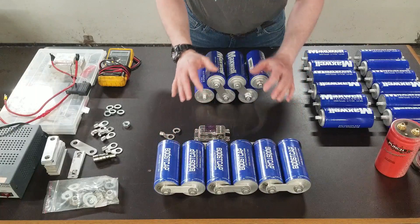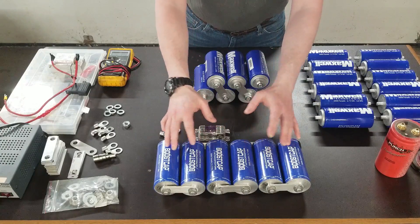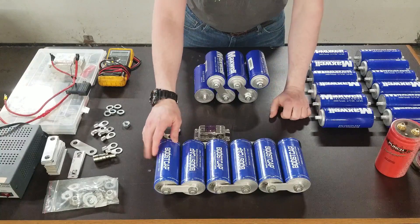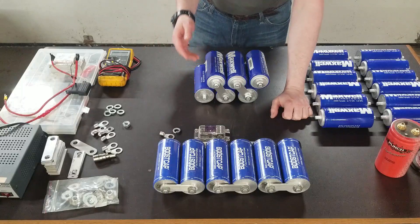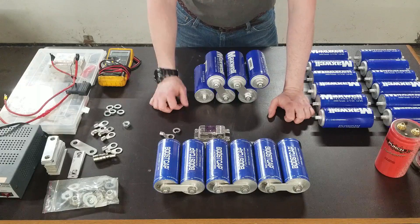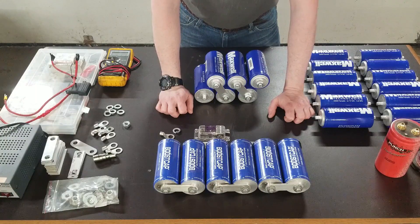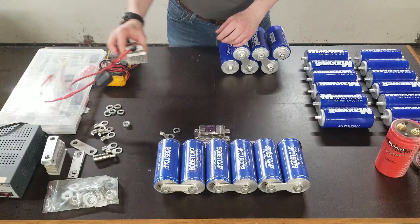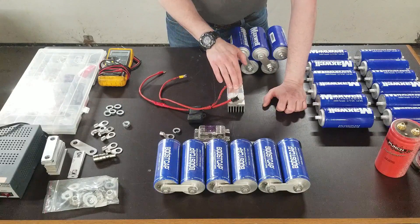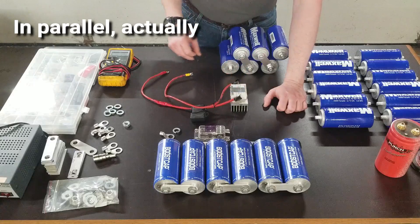Charging these is a bit of a challenge. For a battery you just hook it up to a charger, but these start with no charge. Going from zero up to rated voltage is tricky because they have a very low ESR — equivalent series resistance — of 0.28 milliohms. They look like a dead short and would try to source hundreds to thousands of amps of current. So we have to charge them slowly. I built a small charging rig using 25-watt ceramic resistors — 15 ohm resistors grouped in series on a heat sink.